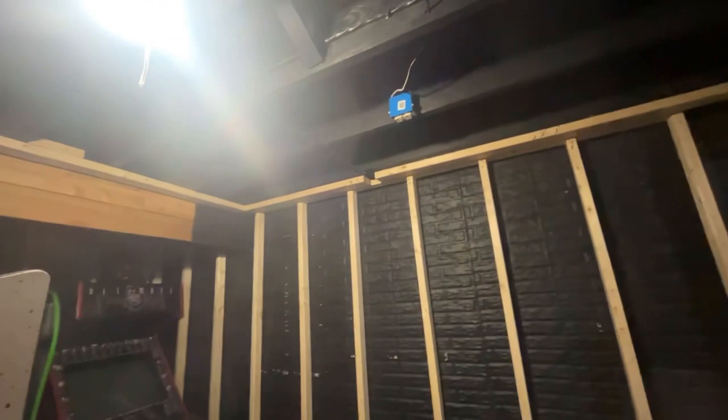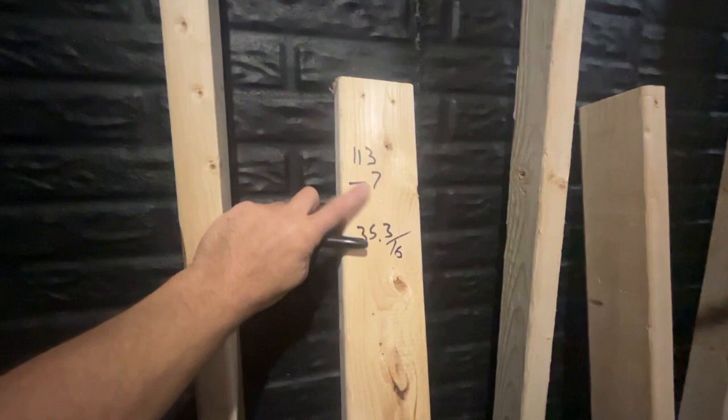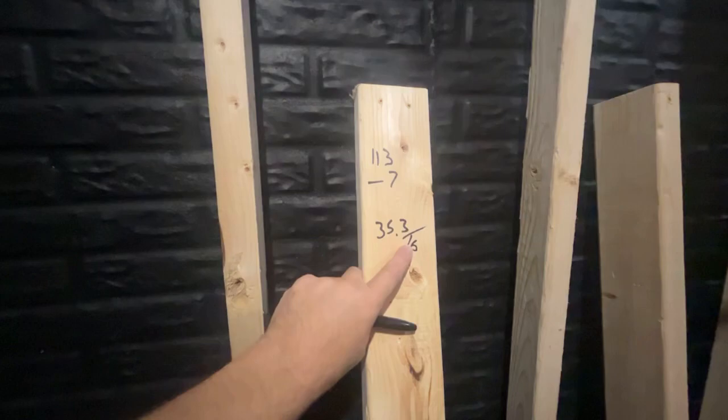I'm going to finish up this first row of two by fours and then run the ones in the middle. All the perimeter is up — first row. Now what I did was I measured where the center stud is going this way and another one going this way, and then we'll divide them going that way. I measured from inside of the stud to the inside on this side — it was 113 inches long. I know I'm going to have two rows of two by fours up there, which is seven inches. So 113 minus seven — take that number and divide it by three — and it comes out to roughly 35 and three-sixteenths. That's the measurement for each size block that goes up there. So now I'm going to take a two by four and run it from here over to that side twice.